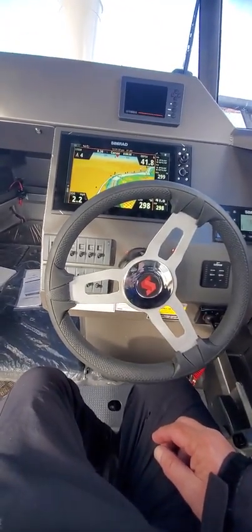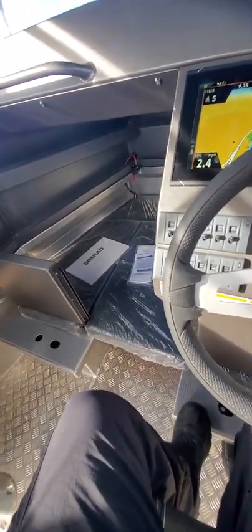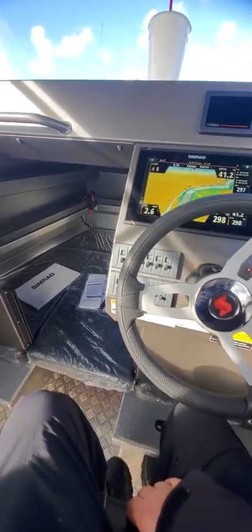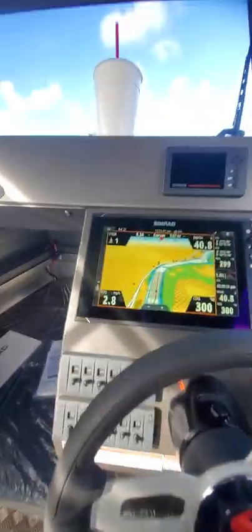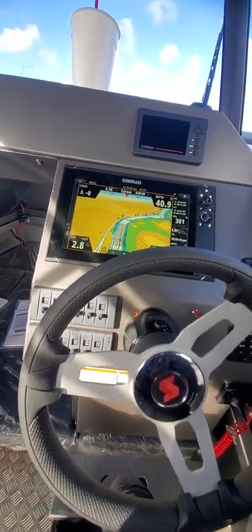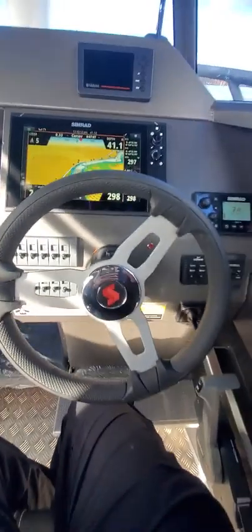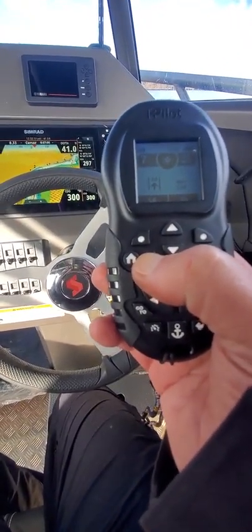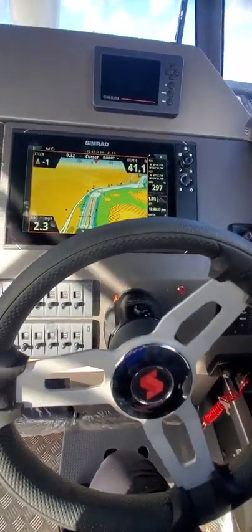Now, if you wanted to keep that thing a little bit better on that line, sometimes if there's a lot of wind, all you have to do is just start up that kicker motor. And just put it in gear. Make sure those are straight back. See how we got that down to like one degree off zero just by putting that thing into gear, 2.8. I could cut back this speed because we're going with the current, so I could cut that back down to about 7. See what it does. 2.5, see? 2.4, I'm holding the line. One off, zero. So there you go, that's another trick.